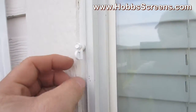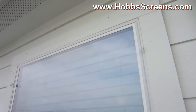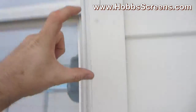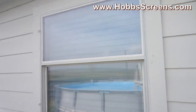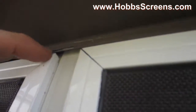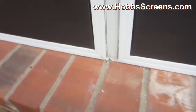For when you want to give your customer the option to easily take the solar screen on and off, these metal turn clips are a great way to do that. The turn clips are about a quarter inch wide, so you have to be careful with your measurements to have that much room on a metal window. I always allow for at least five-sixteenths of an inch in my width. Be sure to watch the below 'how to measure and install rectangular shaped solar screens using metal turn clips' video, as it will in detail explain how to install these turn clips.